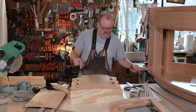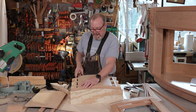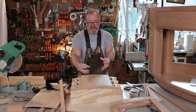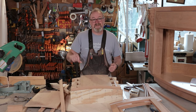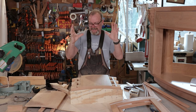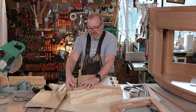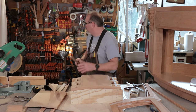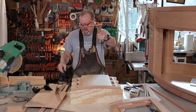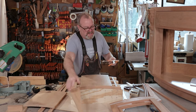It's going to be cool. And we're going to use the jig to lay out the whole thing, and we're going to miter it and build everything on this jig. Then we're going to use the Domino machine from the backside, and we'll probably just tape all the molding onto it, if I can, with my tape trick that I do on everything, because it's curved and crazy. Where this goes and this goes together like that, we'll probably have to pinch them down using these little guys. So on the miter, we'll just go burp, right on the tongue and use these like we would use the face frame clamps. I'm going to do that, and we'll do all this tomorrow.